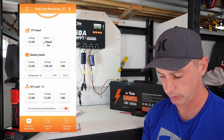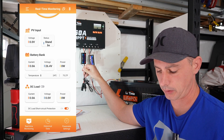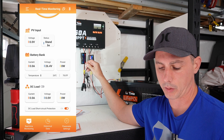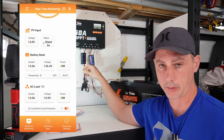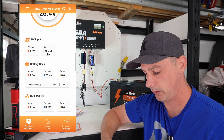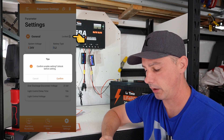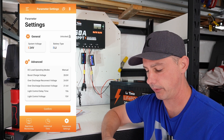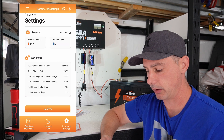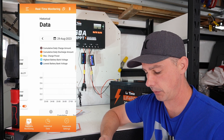Coming down you can see battery bank temperature at 24 degrees. Let's heat this sensor up with my hand — there you go, 26 degrees or 78.8 Fahrenheit, and now 30 degrees. So you can see that's giving me real-time temperature, which is nice. Going over to parameters, we're set to 24 volt and Li for lithium iron phosphate. We can unlock this feature by hitting the unlock button and confirm. I'm quite happy with my boost voltage being 28.8, and all the other settings look good, so I'll stick with the parameters set by the company.